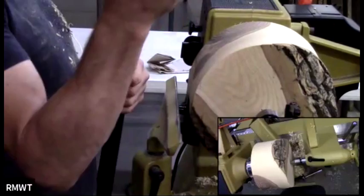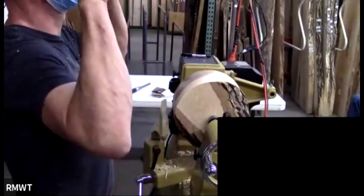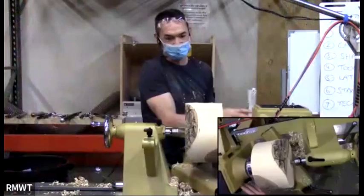Remember, we have the ability nowadays with modern sandpaper, like ceramic sandpapers, even diamond sandpaper. We've got incredible sandpapers. I remember growing up as a kid, garnet sandpaper was like magical stuff. Now garnet sandpaper is like cheap stuff. We don't use that anymore. So people like my dad had to be able to turn with carbon steel tools, not high-speed steel tools, underpowered motors, lightweight lathes, and get a great finish, and then not have to sand it much.